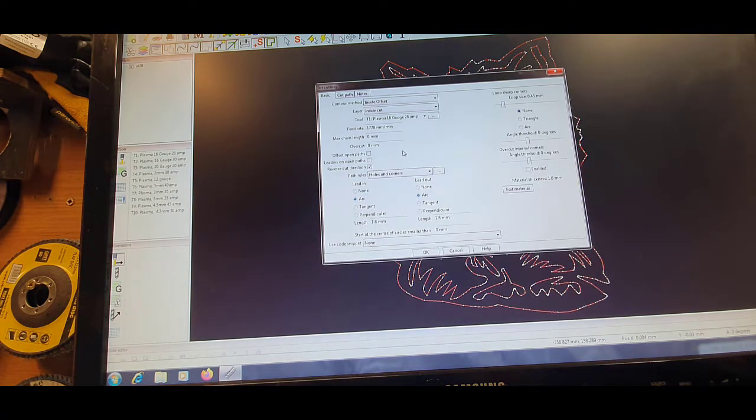So again, these are all the tools that I generally use on this Jasic for the 16 gauge up to about 1.8 mil. So we'll set the offset to inside cut. Generally, you always want the cut direction to be on the right hand side. So basically, an inside cut, I was always shown that it's got to cut anti-clockwise, outside cut clockwise. That's opposite on Sheetcam, so I've just got to tick that box. The rest of them can be left unticked. Inside cut, I use 1.8.